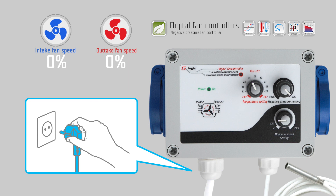To reset the blinking LED, you have to un-power the controller. If such overheating happens, you have to move the controller to a place where you can obtain better cooling.